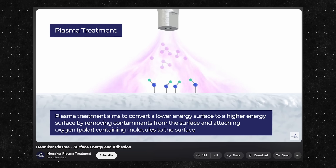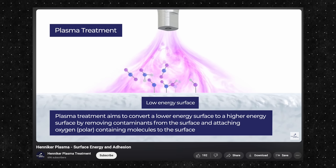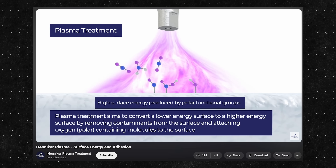You can also use this plasma for surface treatment on composite bonds. All the charged particles in it can bond with dirt and surface contamination, turning them into gas, which increases surface energy and makes the bond much better.